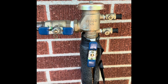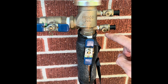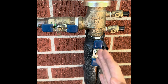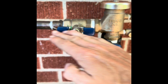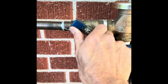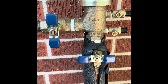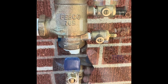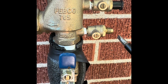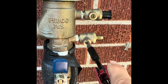Here's the backflow. These are ball valves, and even with these test ports, these are little ball valves — miniature ones you could say. When the handle is parallel with the pipe, no matter the direction of the pipe, when it's parallel, that means it's on. When you turn it perpendicular, that means it's off. And with these test ports, they're miniature ball valves — when they're perpendicular to the flow, they're off; when you turn them parallel, they're on.